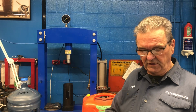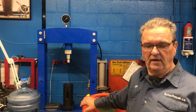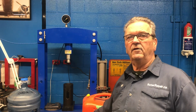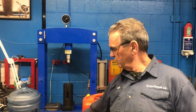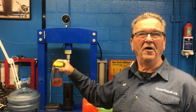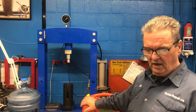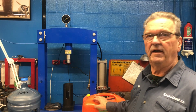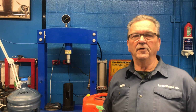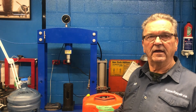So if we switch over and do this in US gallons, assuming 6 US gallons here, then it would take 1 cup to saturate all the ethanol in that sample. Plus, remember, we had some extra water that wouldn't fit in the ethanol, and that would be 1/3 of a cup. So in total, I would have 6 US gallons with the addition of 1 1/3 cups of water to get it to the sample that I have now. Are my numbers absolutely accurate? They're pretty close. I don't really know, but it's as close as I could come.